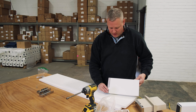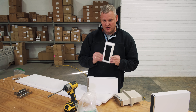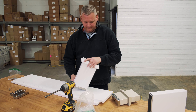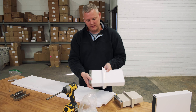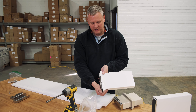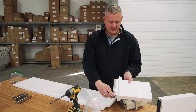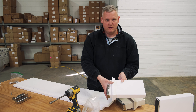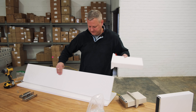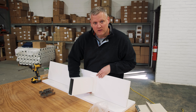You'll notice I put a little cutout here on the bottom side of the rafter, and that's really important because when you go to put your trim ring on your rafter there's a little tab down there, and that tab lines up with a little cutout in the hanger. If you fit that on improperly you can't get your rafter to slide back and look real nice. So the goal is — even though we've got all this heavy-duty hardware to make your pergola real sturdy — you don't see any of it. Once everything is completed you'll have your rafters laid out and hung on your trim board and they'll look like that.